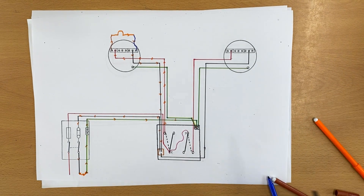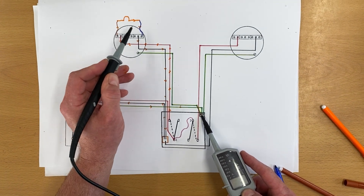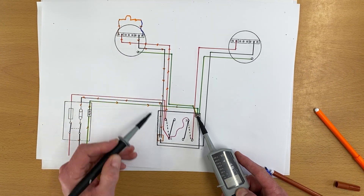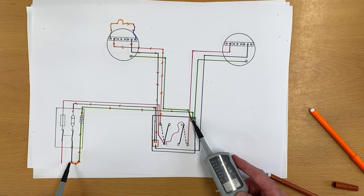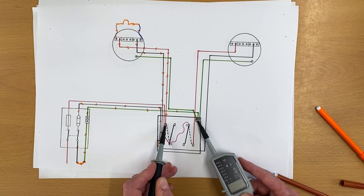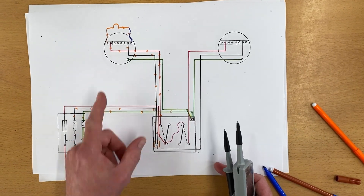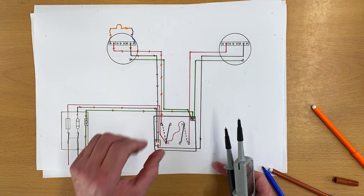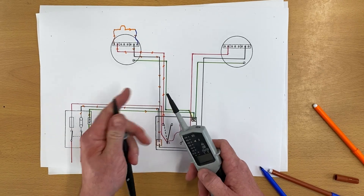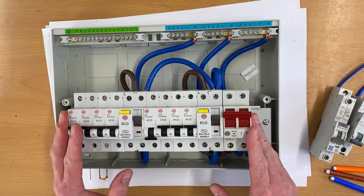When we probe between our switching line conductor and our CPC, the lamp being connected meant the switching line passed through the lamp onto the neutral, the neutral travels through the system, and at some point is connected to the protective conductor in both TN-S and TN-C-S arrangements — hence that continuity beep. So: no voltage, fully isolated, but some people get confused hearing that beeping during safe isolation and think voltage is present. The machine will read voltage if voltage is present; the beep itself indicates a continuity loop, and we've now proved that in three different ways.